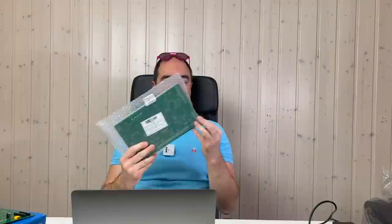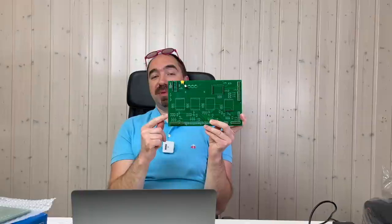Ha! So I received my PCB in this nice box. They're really beautiful. And I even started to solder some components. And quite quickly I figured out that this PCB has a huge error. This was my fault, because in the schematic I put the optocouplers in the wrong direction. And in order to solve this, I decided to redo everything and reorder the PCB.